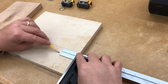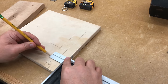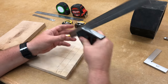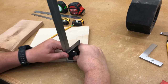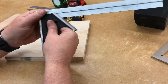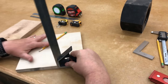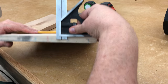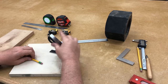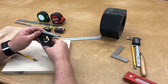If I need a line exactly two inches away from an edge, I can use this to mark that line. If I want to check the depth or thickness of something, we can do that as well — we can read the measurement from there. Or if I want to mark halfway down through a board, I can do that too. This can even be used to check a 45-degree angle in addition to the 90-degree angle, so a combination square is pretty handy to have.